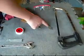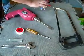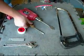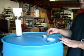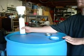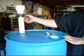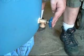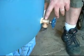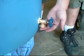Tools needed for this are: a three-quarter inch brad point bit, an electric drill, safety glasses, a hacksaw, a flat head screwdriver, Teflon tape, a box cutter, and a crescent wrench. Other items you'll need to purchase: some two-inch round PVC piping, a two-inch to three-inch sewer or drain connector, some screen, a round clamp, and a spigot. They sell spigots in various sizes — half-inch, three-quarter inch, one inch — just whatever your preference is. It's got a nice hose hookup on the bottom. You'll also need the 55-gallon barrel.